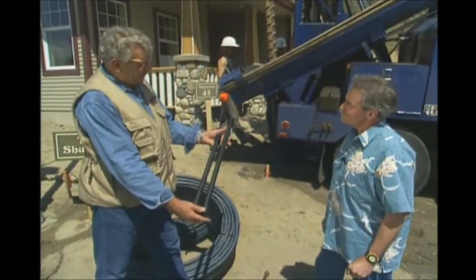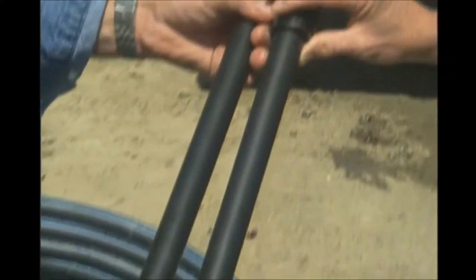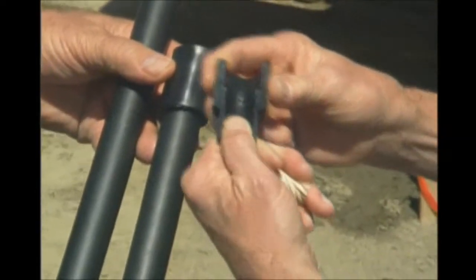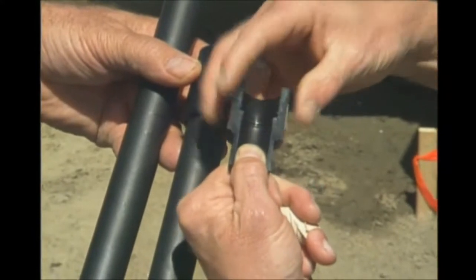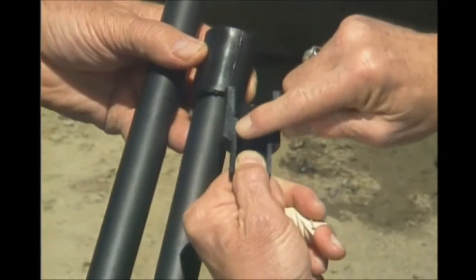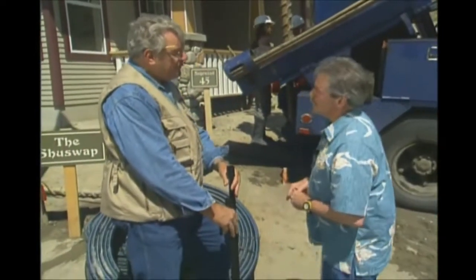As for the pipe connections lasting in the ground, these are fusion-welded fittings. Here is a U-bend and a connector — we use a fusion tool to heat the pipe and the fitting at the same time, then bring the two together. As you can see in this cutaway, where the pipe and connection come together there is no seam anymore — it has actually become one with the pipe.